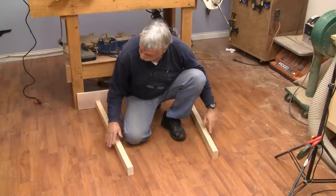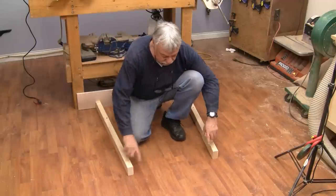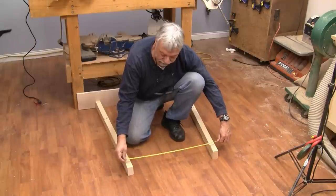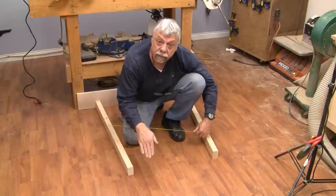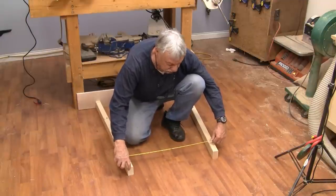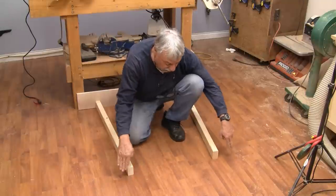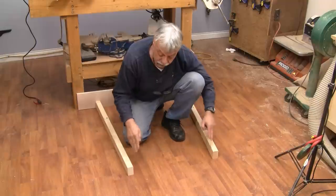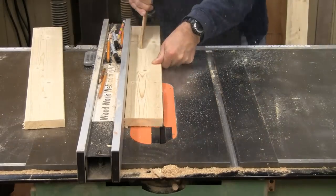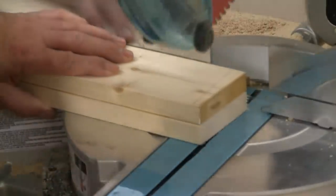I'm sitting up on the floor because it's easier — I've got a board across the workbench with the legs up against it. What I'm going to do now is cut the top brace across here; I want this to be 25 inches from point to point. I also need to put a five degree angle on it so that it'll sit flat on top, because the top apron is going to sit just a little bit proud of the legs. I'll go to the table saw to cut the five degrees off, then to the sliding miter to cut the sides so the front and back are exactly the same.